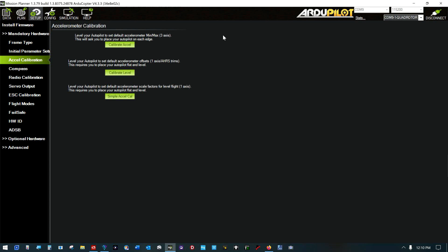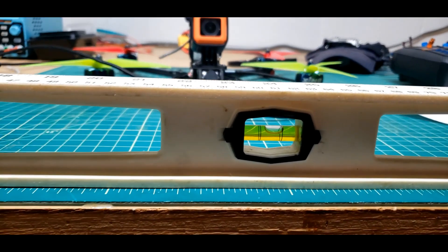I also did the compass calibration the same way. Telemetry connections are beautiful things — it's an invisible USB cable to the platform. I have so much love for telemetry, and I want to continue that love in the air 30 miles away with a telemetry connection, as if I had a USB cable to Mission Planner, QGroundControl, or just telemetry recording software. But if you're calibrating accelerometers by holding any platform in the air, you're probably not going to do the best job, and what you'll find in the field is these platforms drift around, like they did yesterday.